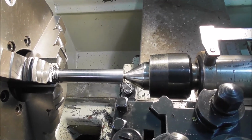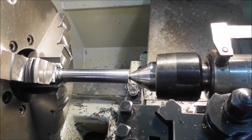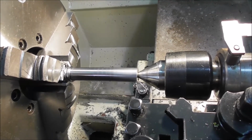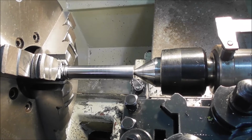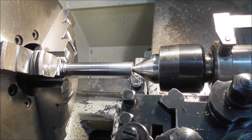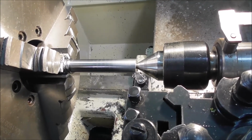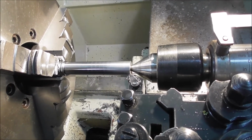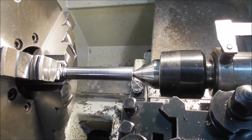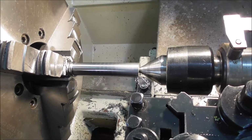So I'm trying to reverse engineer why this is the case, and probably the machinist that takes the stock lengths of ball screw and machines the ends on them, tempers them at the end. Probably manually tempers them with a gas torch, heats them up hot enough, something like a 1045 steel probably, that's induction hardened to perhaps 60 Rockwell C at the mill where the ball screws are rolled, but the machinist tempers the end right down to 30 Rockwell C to make it a doable job, makes it easy to machine. So if you're going to machine an existing ball screw, you've got to think about this, that the ball screw itself is probably very hard and very difficult to machine.